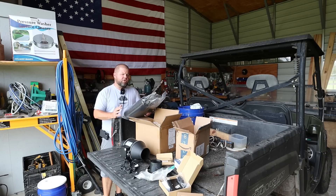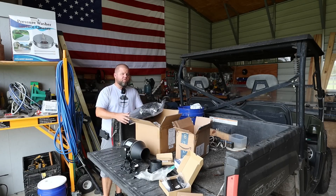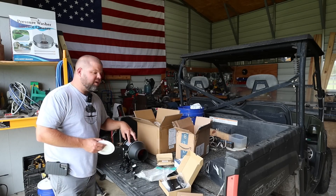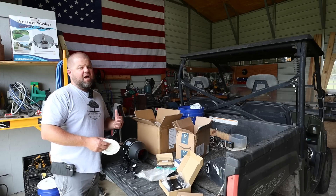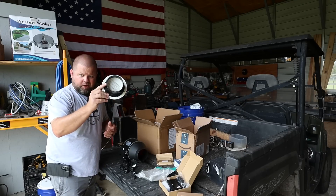Since we're going to be pulling fresh air into that room, it's going to be air coming out of the shop, which may be a little dusty, a little dirty, depending on if I'm doing work or not. So we're going to want to filter that air before it comes in. I bought a bunch of pre-filter material and we're going to pre-filter the air coming into the room in two different locations. They make these fans in four-inch and six-inch versions, but looking at the CFM — 212 CFM, that's 212 cubic feet a minute — I can turn over the air very quickly in that room, even with the four-inch fan. And four-inch stuff is a whole lot easier to install.